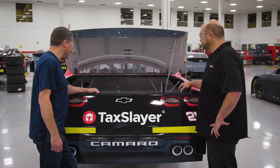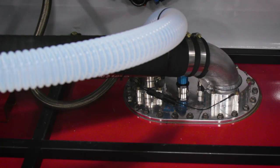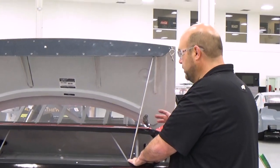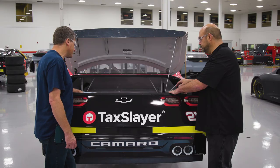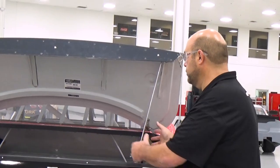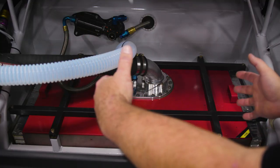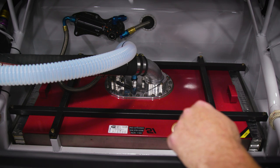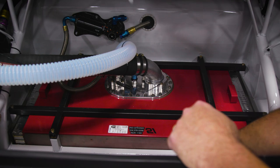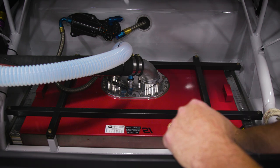See if we can help you out. So this one's complete, right? Absolutely. It's just like we'd go to the racetrack with — 100% NASCAR legal. Everything there is done for safety. Make sure it's sound and erect. It looks like it's mounted right in between the frame rails, right up tight. So we're centered in the car. We've got a little bit of intrusion foam to allow for just a little bit of a crush area. Frame rails are 083, 2x3 box. The front and rear rails are 1x3, 065, and all of the structure you see is 65,000 steel.